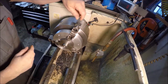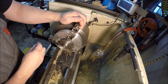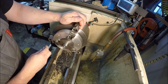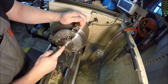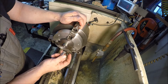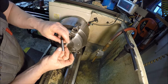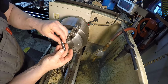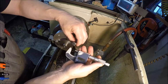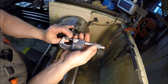Alright, I'm checking the measurements on the bore, and I thought we'd do a short little discussion on different tools and instruments to measure this thing. For holes under an inch, the reason why I like gauge pins so much is because of the accuracy. So we're shooting for 529. This is a 528 minus gauge pin, which means it's just going to be a smidgen under 528.